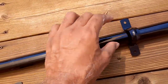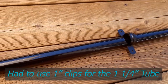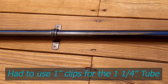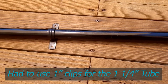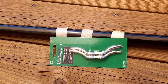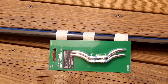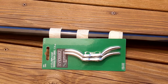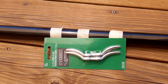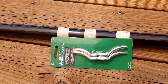Here, one here, and maybe one at the bottom, so that I can get it connected to the deck post, so the rails will be kind of secure. Here I'll have to pre-drill holes into the metallic tube of the chain link rail tube, and that's what is important, because I'm going to use metal cutting fasteners or thread cutting fasteners into the metallic tube